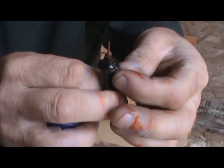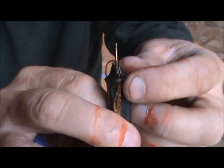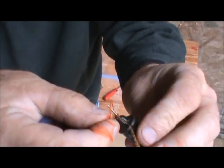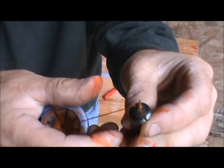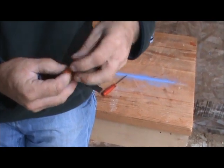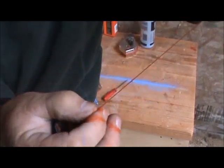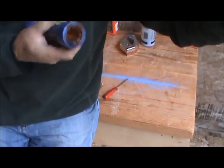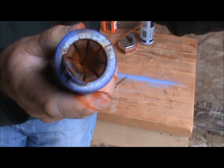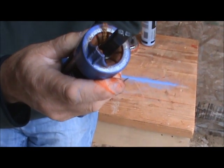For setting up the ink line: on the pin, tie a little knot and leave it in the slot, then bring the cable up, put a little loop in it, slide it over the pin, and pull it tight to lock it in place. Also, pull your cable out about six inches and put a small knot in it. Because the hole gets caked up with sawdust, this knot acts as a cleaner each time it passes through both holes, without getting in the way of anything.